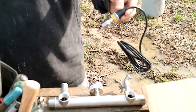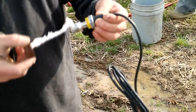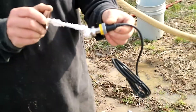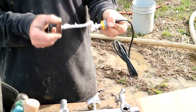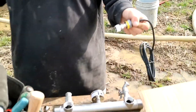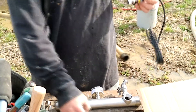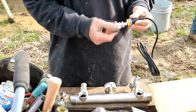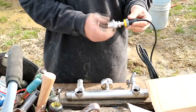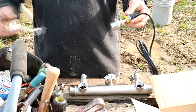We're dealing with nothing but stainless steel here due to the fact it's all submerged in water. And here is the transducer. The transducer is what allows the controller to know the water pressure on the water system. If the pump needs to run faster for more pressure or slow down for less pressure, the transducer is the communication device that initiates everything.